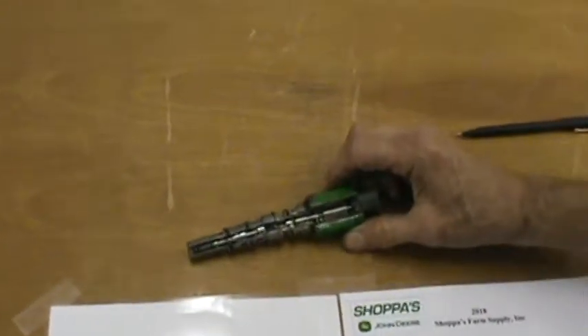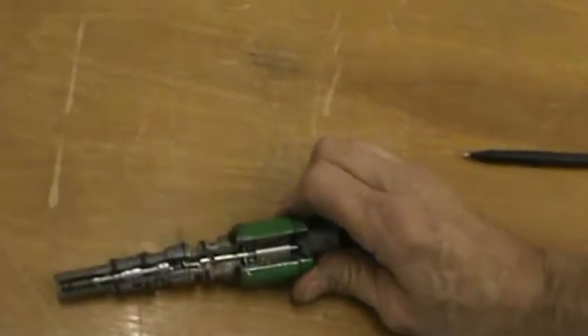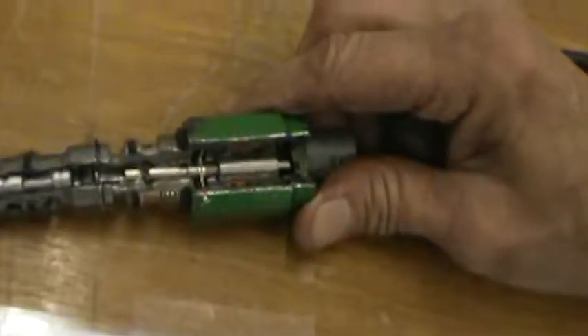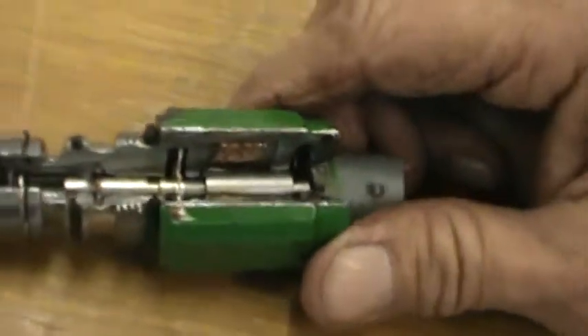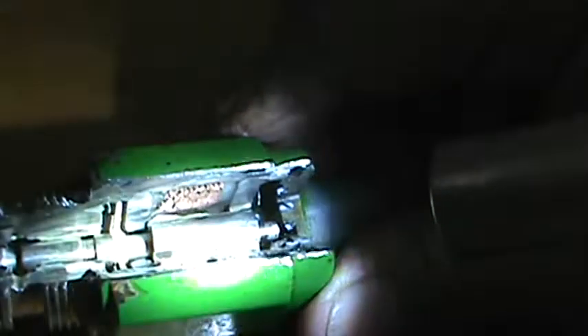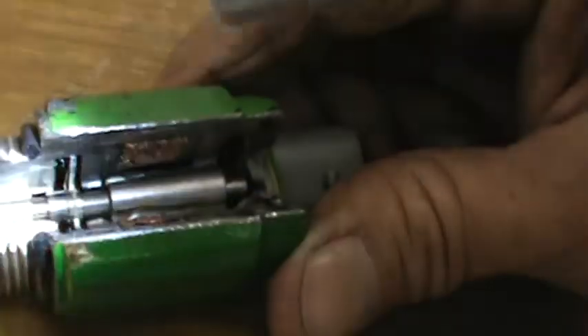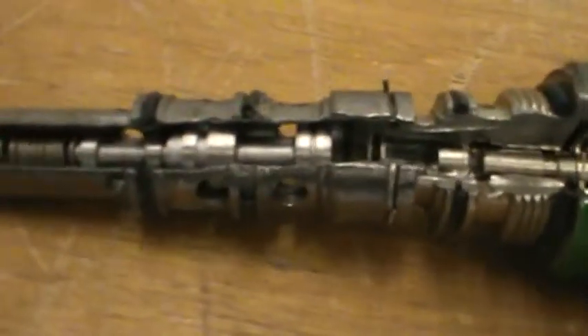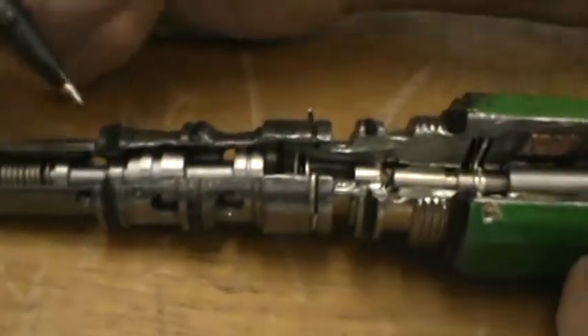This is an electro-hydraulic valve. It is described as an electro-hydraulic valve because you have hydraulic controls which need to be manipulated, but you also have an electromagnetic coil here. When you apply electrical current, it will actually move a spool within here, which moves a spool there and directs oil down to the desired functions in the hydraulic circuit when this is moved.